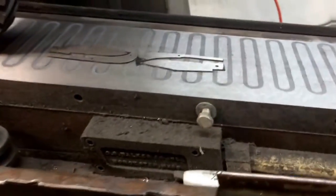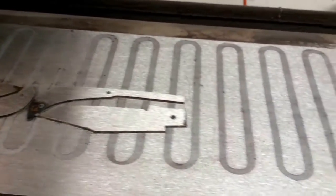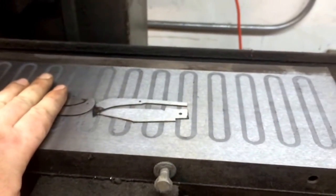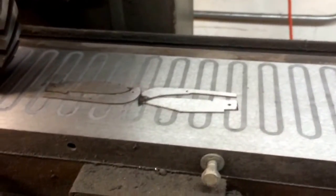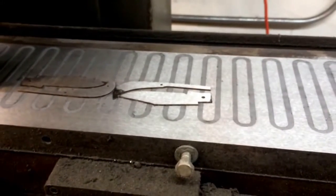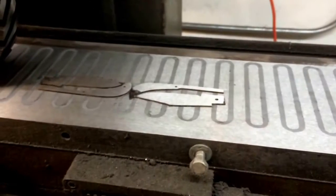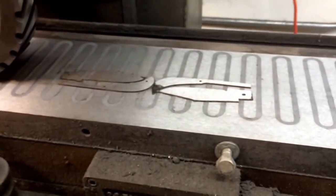I've pretty well surfaced both sides with a 120-grit belt. You can probably see it's still a pretty rough surface, so I'm going to switch to a Trizac belt, which is quite a bit finer, and go ahead and try to get basically the finished final polish as far as the tangs are concerned. We still need to grind our flats and take a little bit more metal off at the belt grinder, but this will at least make sure everything's flat and parallel, and at that point we can start roughing everything in to begin trial assembly.